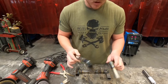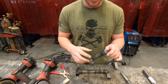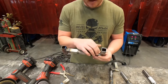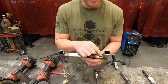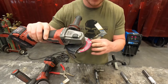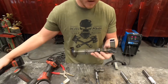When it comes to grinding these, remember I want you to grind two of them — one round tube and one square tube. The round tube weld seam I want you to grind is your butt joint. For square tubing, I would like you to grind your corner joint. You don't have to grind the inside corner. The reason we don't grind inside corners on any project is when you're grinding them, every time you run off that weld, you're running the edge of that grinding wheel against that tubing. All you're doing is putting a thin spot in that wall, which is going to cause tube failure — you're structurally unsound at that point. So we don't grind the inside corners.